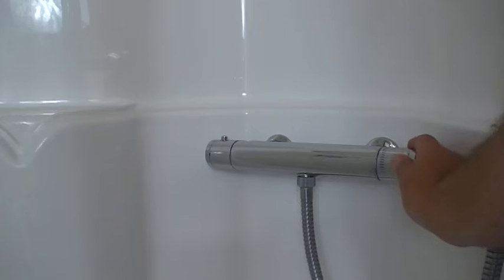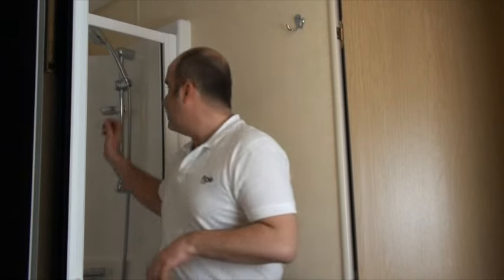To drain the cold pipe, the first thing we need to do is turn the shower all the way to cold. You'll also want to lift the shower head down to stop any water running back into the mixer block. Then when you're ready, simply turn on the shower. When the pipe is drained, just remember to turn the shower off again to seal the system once more.